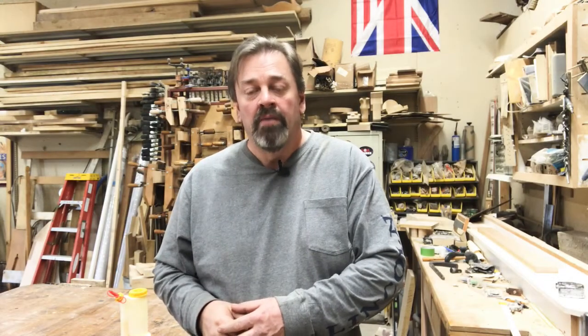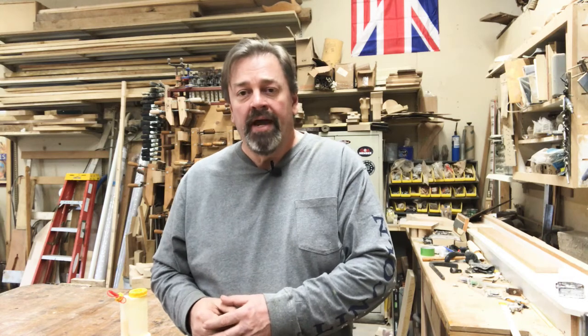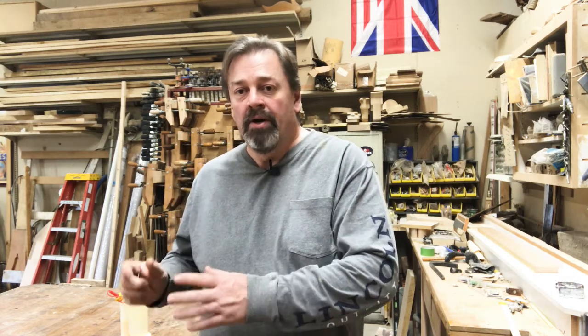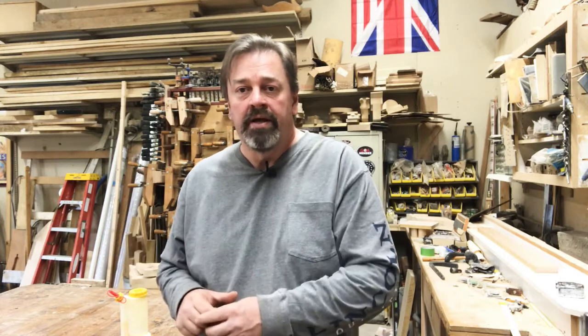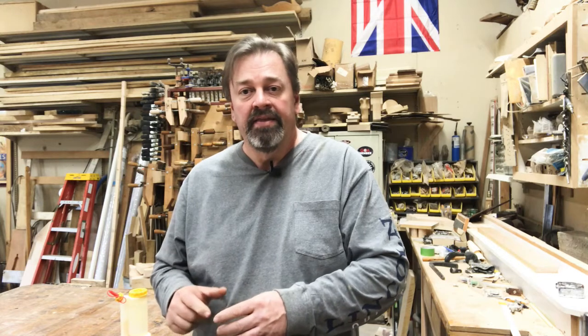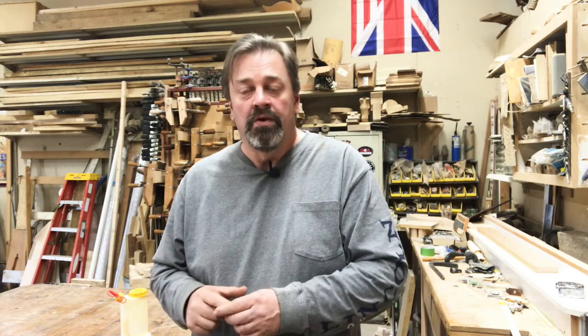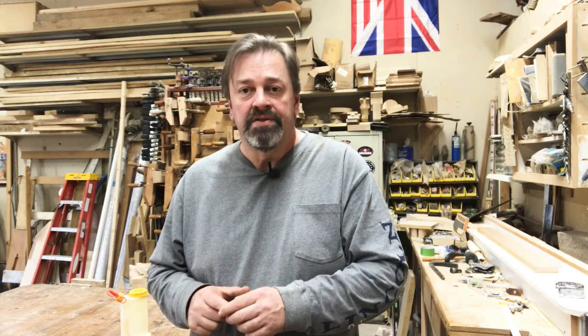I'd say that's a pretty good place to stop right now. I'm real happy with the progress we've been able to make over the last few days. When we come back, we'll get our middle body blocks out of their clamps, and then we'll start fitting those to the base of our rocking horses. Then we'll start gluing up material for the head, the neck, and the neck muscles, and we'll get those prepped and ready to go. We're gonna get everything glued up before we start carving. And then once we get to that point, that's when the fun begins. So you're not gonna wanna miss that.